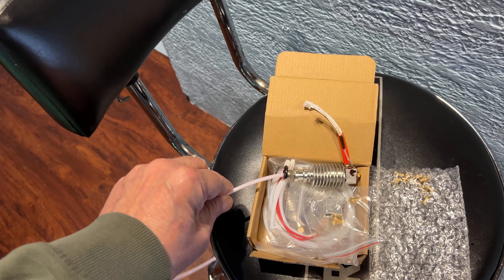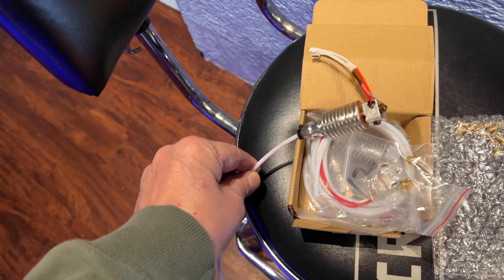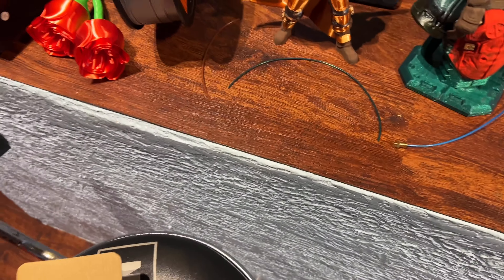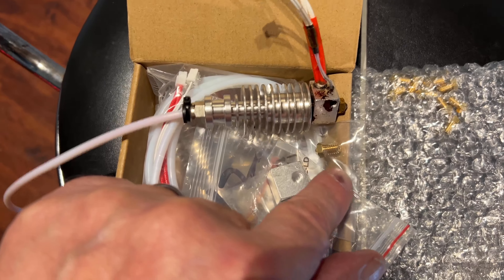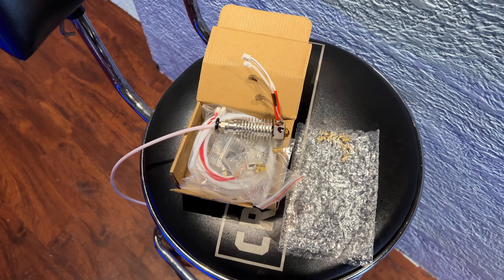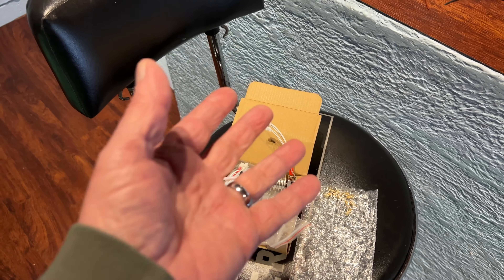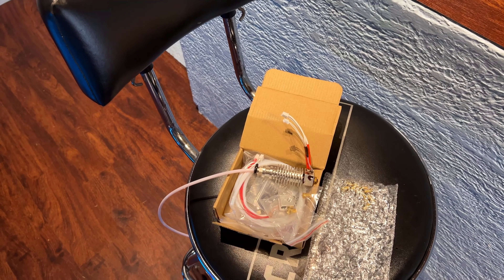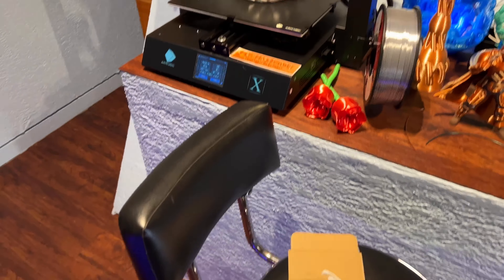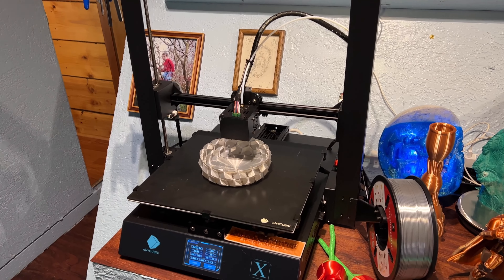The second thing is the actual heating motor. You can buy and replace these things pretty cheap — I think they run me about ten bucks a head, and it comes with the temperature sensor, the heater, and the nozzle. I replace the little nozzle every month with constant runs; they're maybe 50 cents a piece. Don't pay a ton for those better nozzles because you're going to be replacing them anyway.